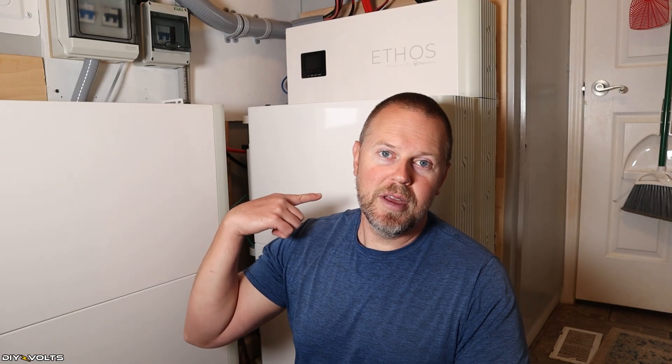I hope this one-year update on the Big Battery Ethos 48-volt lithium iron phosphate system is helpful to you. I really can't say anything bad about it. I like the way it's modular and easy to move — you don't have to worry about picking up a 300-pound battery; you can pick up 100-pound modules. If I had to say something that was a slight drawback, it's that they are indoor only. You can't put these outside because you can't charge them below freezing, so they do take up space inside your home. But I was able to double-stack these behind me and use a fairly small footprint. That's my one-year update. If you want more information or to buy these yourself, I'll have a Signature Solar link in the description. I'm Seth with the DIY Volts channel, and I'll see you in the next one.